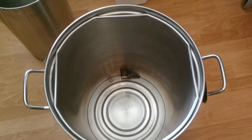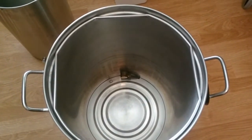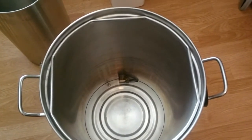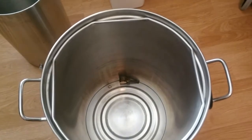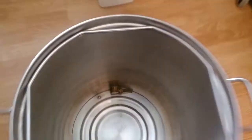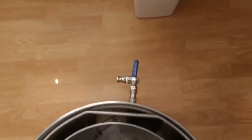Here's a look at the dip tube. It's basically a half-inch female pipe thread to 3/8 compression elbow. You need to cut the excess threads off of the half-inch part to enable the basket to still slide in there and give you the clearance that you need.